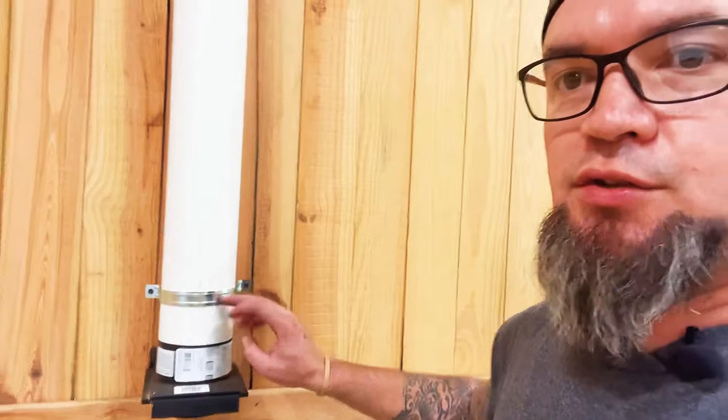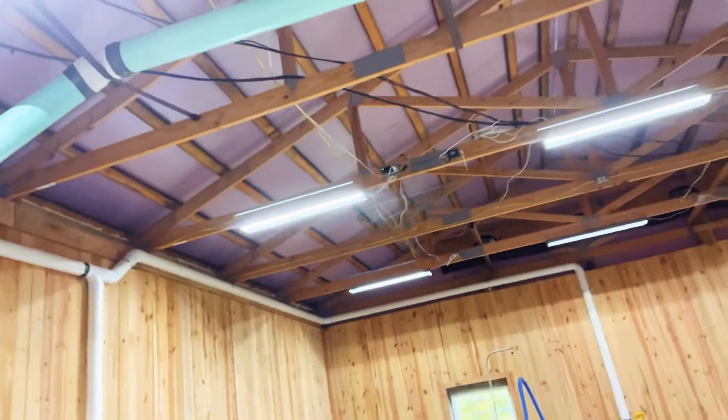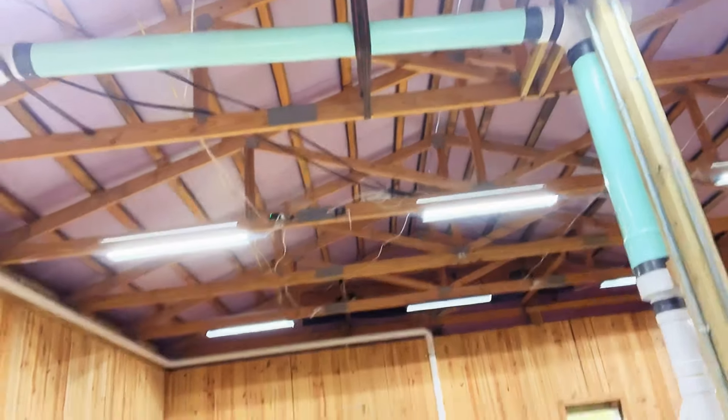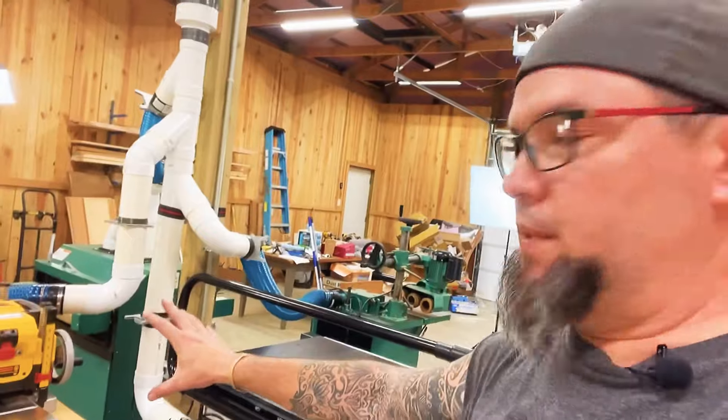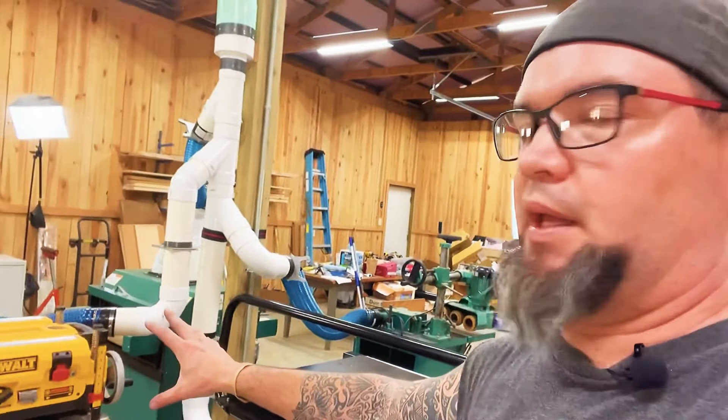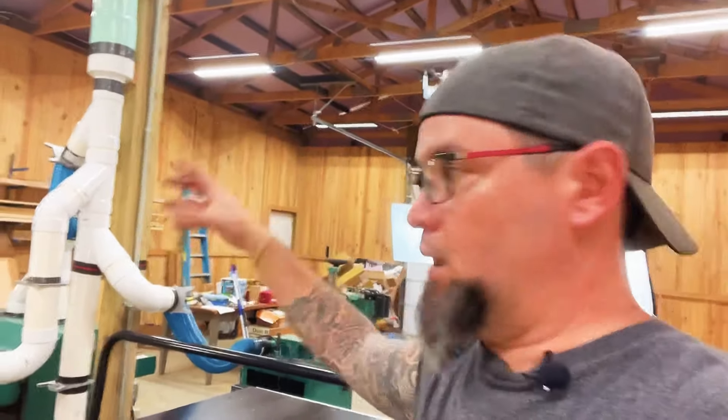Make sure to pick up some of these little metal brackets — they're cheap. Make sure to pick up some for your four-inch line. Now for the six-inch trunk line, if you're going to do that, I have those strapped to the rafters. Do not glue up your PVC. What if you want to move it? What if you want to add to it? What if you don't like the way a leg is kicking out? Like I mentioned, I'm going to be replacing this with a 20-inch planer — it's going to have two six-inch ports that will have to come up, so I won't even need this leg anymore. I don't want to come in here, cut it all off, cap it, and do all that stuff when I can just disconnect.